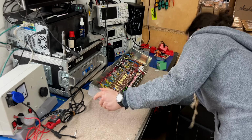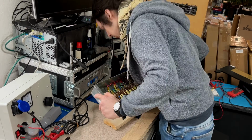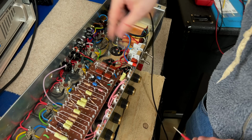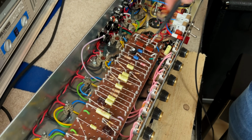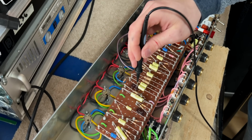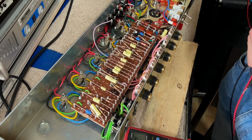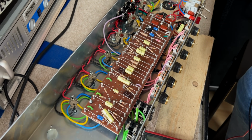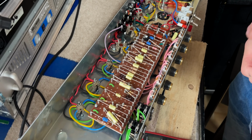Yeah, it looks like an old amp. Yeah, so you've got your main rectifying diodes here. For the power, you've got your little bias supply. And then these ones are some silver mica caps. They're not the most reliable in the long term. I've replaced a lot of these before. So it might be worth changing them to improve the reliability a bit.